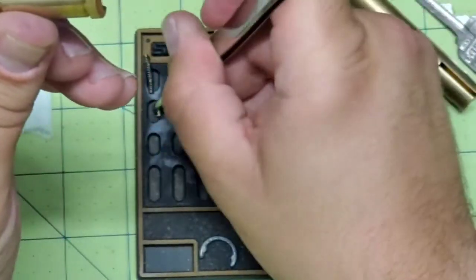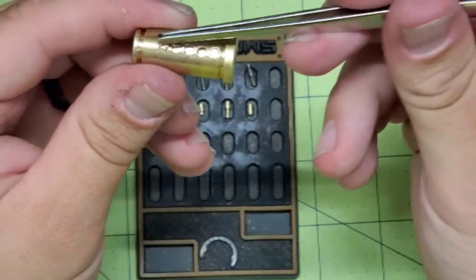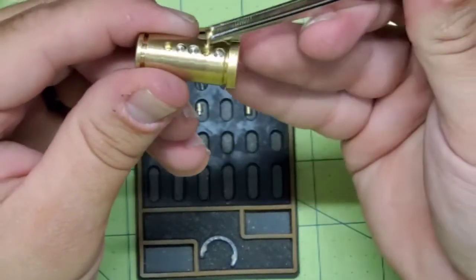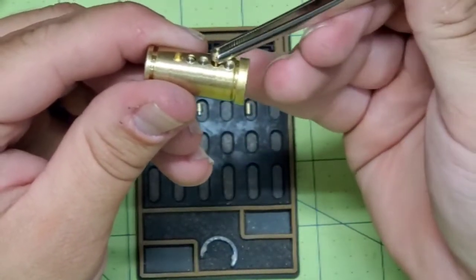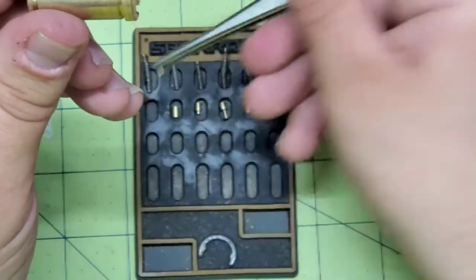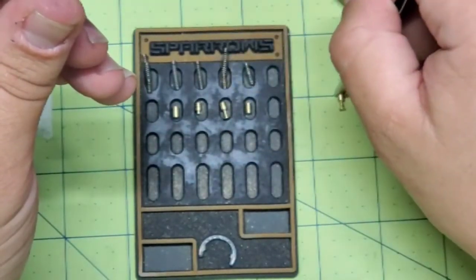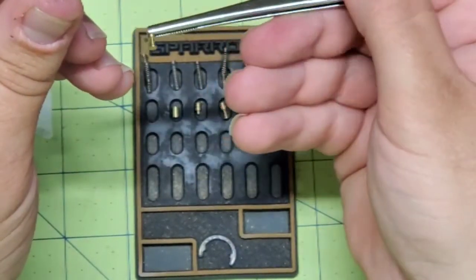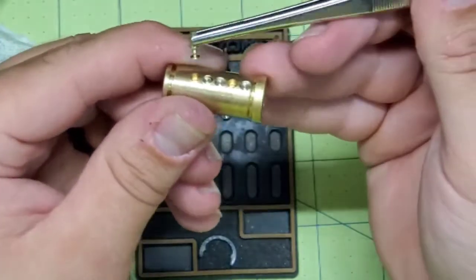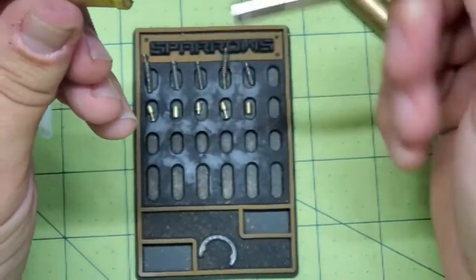So be mindful of that when you're deciding what your driver pins are going to look like based off of your key pins. You want to make sure that you're using something that's actually going to come into effect. Otherwise, you're just wasting your time. You can make a pin that's got, you know, a lot of work into it, that looks super cool, and that's great, but it's not going to actually factor into picking of the lock. So make sure you're mindful of that.